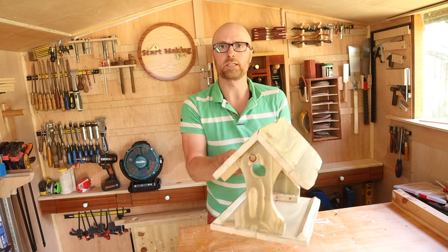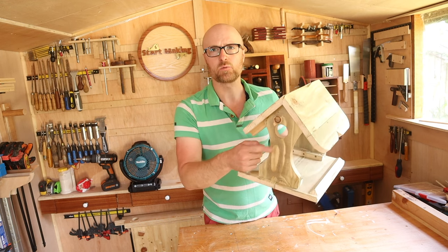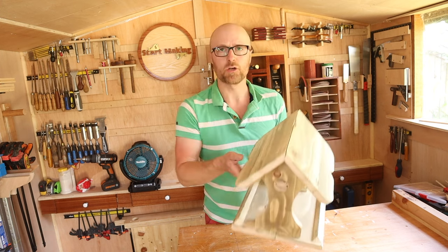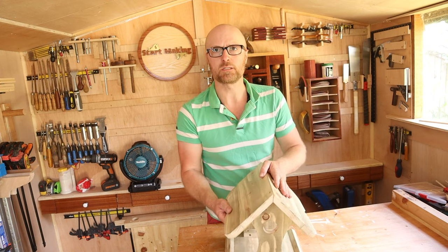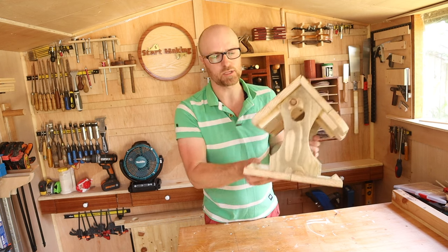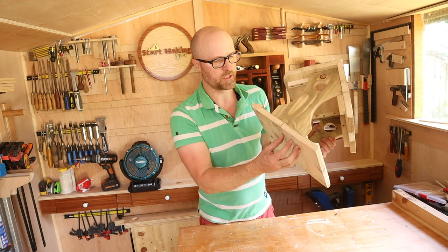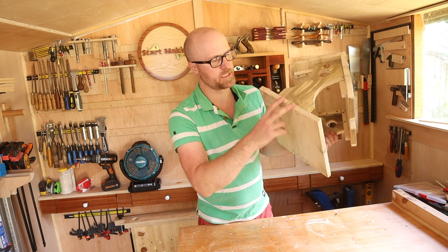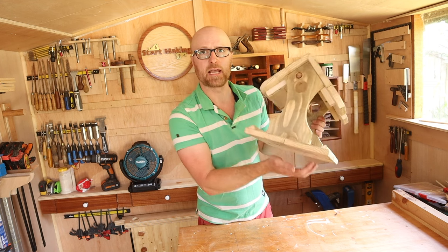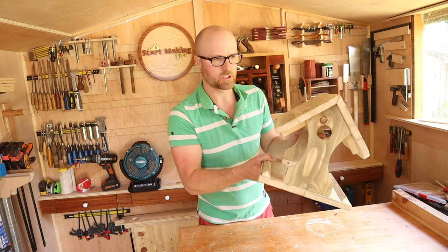One thing that I will point out is, as before, these were internal screws. Pop some external screws in yours, it'll last longer. Also, those of you worried about wood movement, this has been outside for a long old time, and I tried to keep the screws in positions where the wood could expand and contract, so all of the ones on these two boards are in the center. Hopefully the contraction will happen on the outsides, so it shouldn't crack too much in the middle.